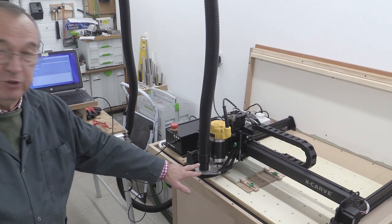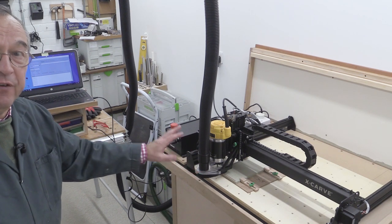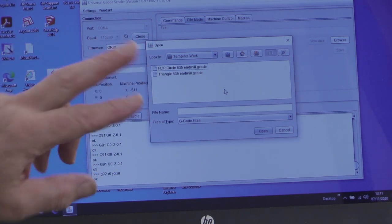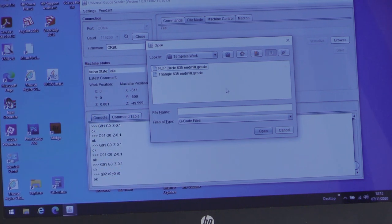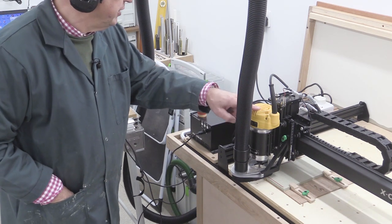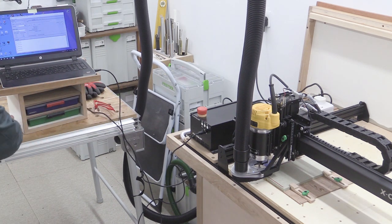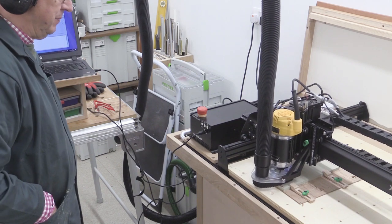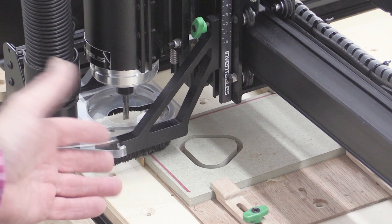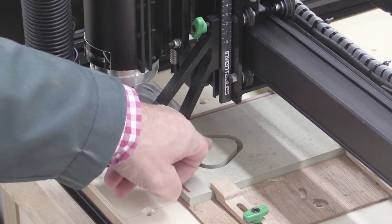Having done that, I can now issue a command to tell the machine it's in the home position for the job. The command I use is G92, then X0 Y0 Z0, and I always check that very carefully. So the machine now knows that position at the bottom left hand corner on the top surface of my piece of wood is the home for the files I'm going to send it. I'm in file mode on the Universal G-code Sender and I've got two files to send one at a time, with a flip in between. The first one is the triangle. I've turned on my Dewalt router and my extractor and I can now send the file. That's done — you can just about see the shape cut out and the centre piece did not come detached from the double-sided tape, thank goodness.